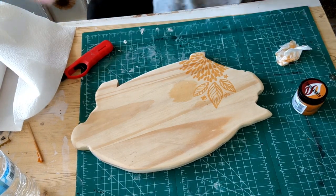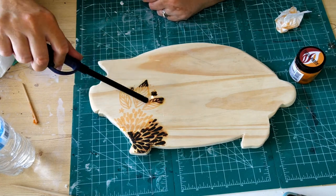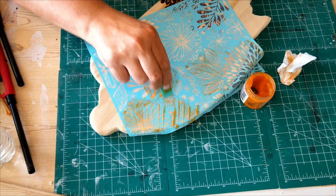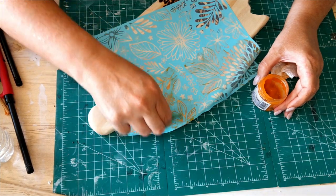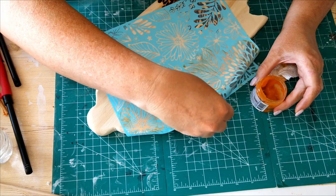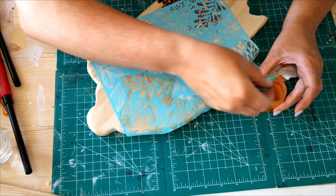I'm using an open flame to accomplish this method. You could also use a heat gun, but it's not very directional — the heat is wide and it would be hard to concentrate your burning in the area of your actual image. Also, it's not very hot, so you'd cause a lot of overburn over a wide area. I feel like an open flame is probably the best way to accomplish the burning here, and I like the way it looks.